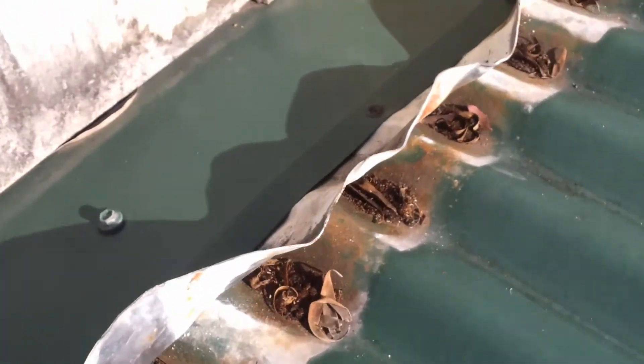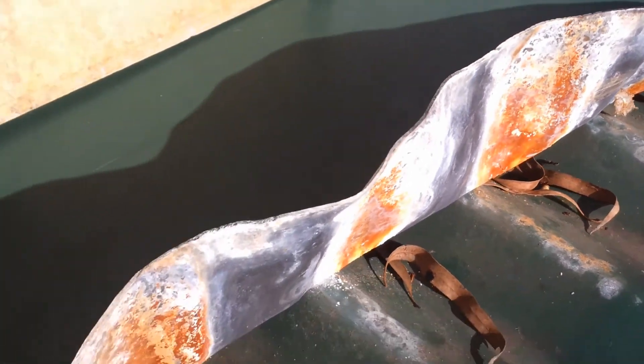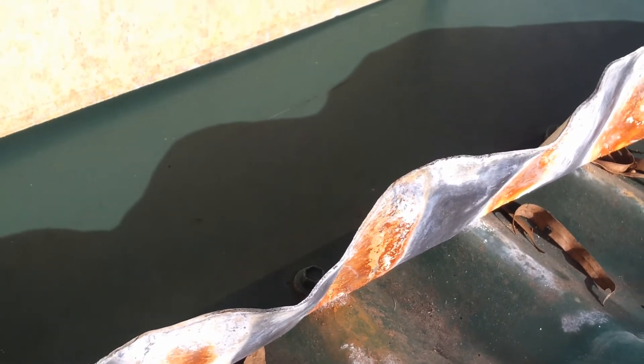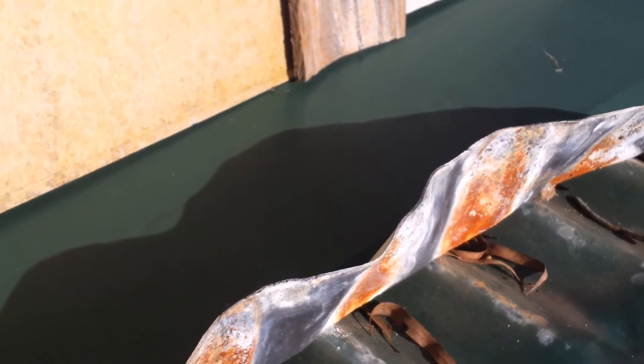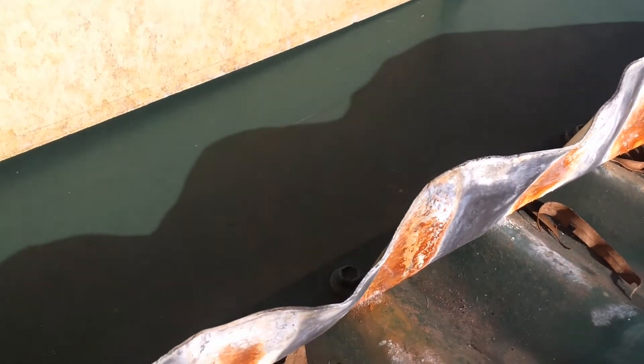There's not a lot of rust on the colorbond, and the roof has held up quite well over the 6-7 years it's been on. So colorbond tends to be a bit more resistant to lead, but as we saw, the rust will start after quite a long duration. That's another example of dissimilar metals — colorbond tends to be better than zincalume. You would expect a zincalume roof of this age with lead to be quite rusted and needing repair.